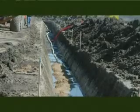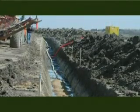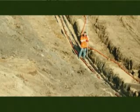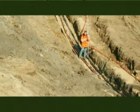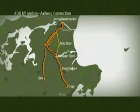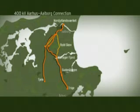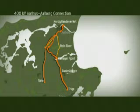Immediately after the laying of the cable and prior to the filling of the trench, the exact position of the cables is determined in a nationwide grid system. Moreover, the cable elevation is entered so that it is subsequently possible to find the earth cover above the cable along the entire cable route. The depth at which the cable is laid is a central factor in determining the transmission capacity of the cable. Any crossing lines are also registered and entered in the system.